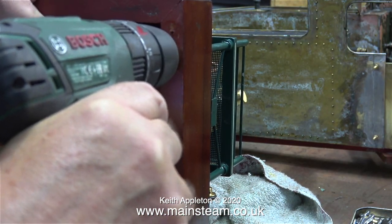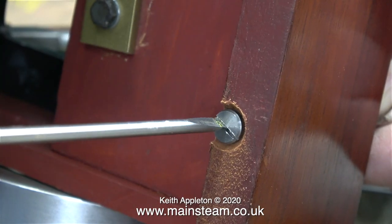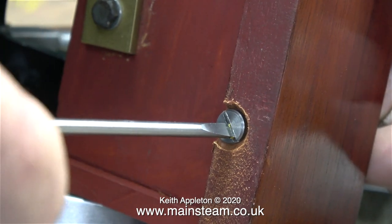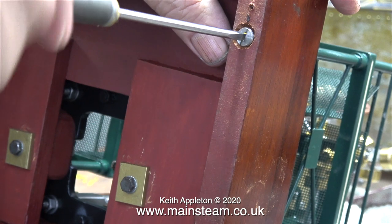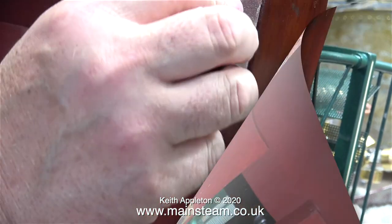For a quick fix, all I'm going to do is use a countersink in my electric drill. Even though the hole at the bottom is very off-center, I managed to countersink it successfully because the point of the countersink follows the hole. It doesn't look particularly pretty, but it's the only way out of this problem, and it is after all underneath the baseboard and fully out of sight.